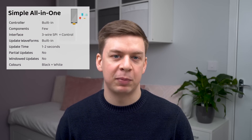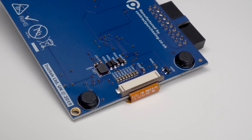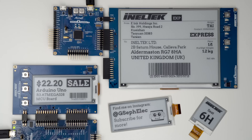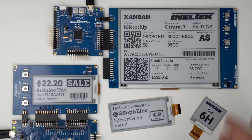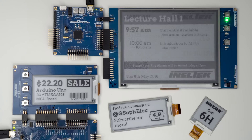We're going to start by looking at the most commonly found e-ink displays: simple AIOs or all-in-one displays. These are very easy to get running, requiring only a simple three-wire SPI interface and some control signals. Most maker projects use these kinds of displays. They only need a few external components — decoupling capacitors, some diodes and an inductor, which work as external components to the onboard DC-DC converter. These displays are cheap if you have a glass-backed one rather than a flexible plastic-backed one. Simple AIO displays are always black and white only, have relatively slow update times of around one to two seconds, and are only capable of performing full updates on the entire display — no windowed updates and no partial updates.